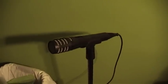To better understand the concept of noise gating, or a gate in general, consider a microphone like this one. A microphone by itself has no ability to discriminate against unwanted sounds, other than by virtue of choosing a pickup pattern which might exclude the unwanted sound. But if you can't manage to do that, you can place a device known as a gate between your microphone and the rest of your sound equipment. The idea behind the gate is that when it is set right, it won't open at any time other than when the desired sound is coming through. So hopefully that will eliminate the unwanted sound from the finished product, be it a sound recording or a live performance or whatever.